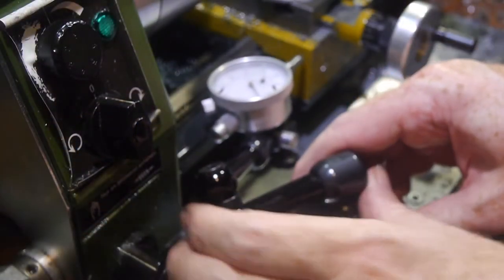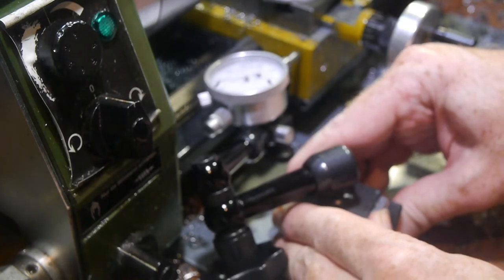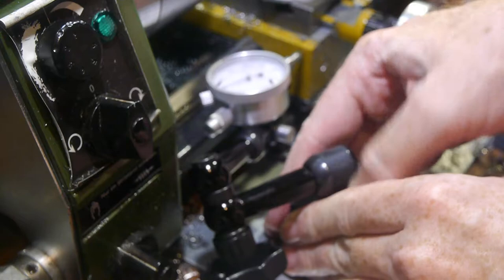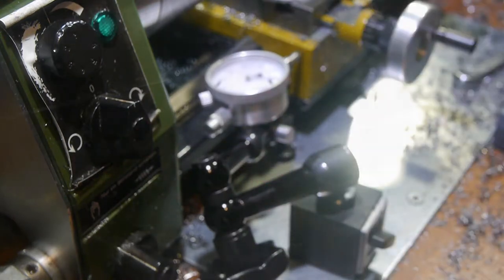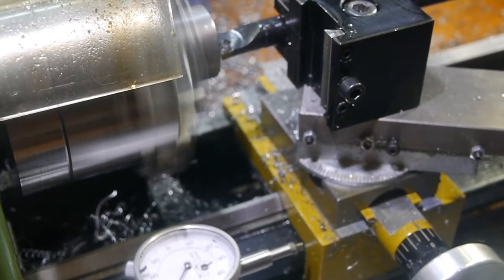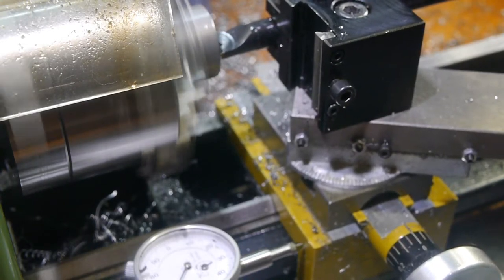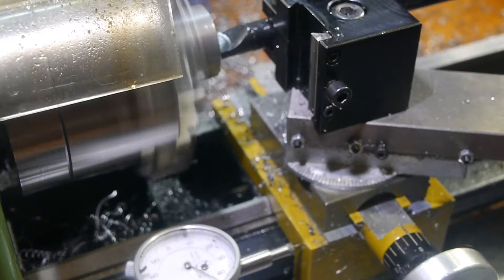Despite the difficulty, I managed to get the part bored out to the adapter outside diameter of 23mm and set up an indicator to measure the bore depth for the thread. 25mm by 0.5 isn't a standard thread I could find, so I based the relative dimensions on a 5mm by 0.5 thread and bored it out to 24.5mm.